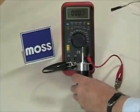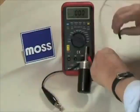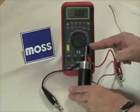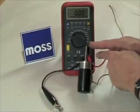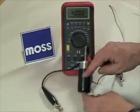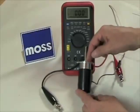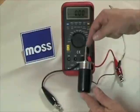So where do people get into trouble? If the linkage for the solenoid — which connects to this and goes to the valve inside the transmission — is not adjusted correctly, it won't be allowed to go all the way up. It'll hit or bump into something. If it can't pull itself all the way down to drop into maintenance mode, it'll stay in operational mode, and this thing is going to die on the job. We get a few calls each year from people who buy one of these, then a second one, saying 'I'm melting these — what's wrong?' It means they're not adjusted correctly.